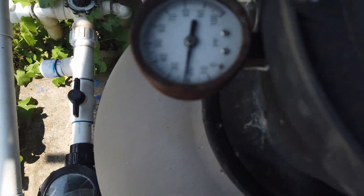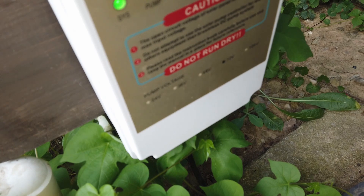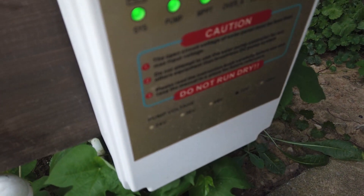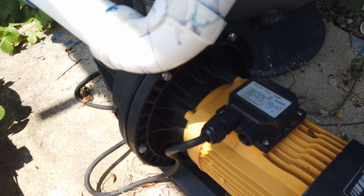As you can see here, the pressure is good. My PSI gauge is showing about 21 pounds per square inch, usually from about 9 to 9:30 a.m. until about 8 p.m., when it starts to go down to 10 and then trickles out until about 8:30. Every morning when the sun comes up, the controller turns it on automatically. As long as I leave the controller box on, it'll come on with the sun, run all day, slowly go off with the sunset, and come back on the next morning with the sunrise. I've been so pleased with this system.